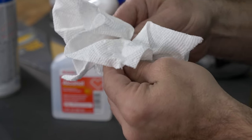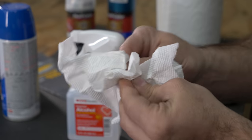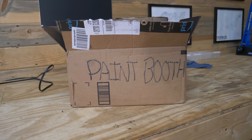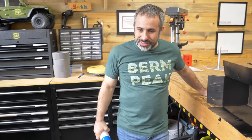The next thing we have to do is remove any sort of grime or grease — I'm going to use rubbing alcohol — and then put it in your paint booth. When you're spray painting, do it in a really well ventilated place, like all the garage doors open, close to the garage door. I'm going to shake it up really, really good.